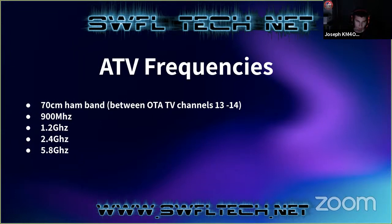The lowest we can use it is 70 centimeter. We can't use 2 meter either because that's not 6 megahertz wide, and if you did, you'd be covering up everything. 70 centimeter is the only band that actually has enough room in it to be used. And that's the other thing: the 70 centimeter band actually sits between channels 13 and 14, I believe. I think I'm saying that right.